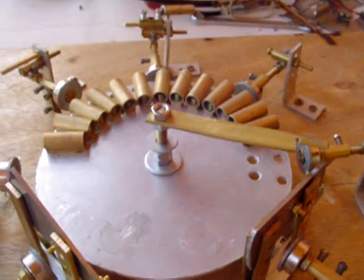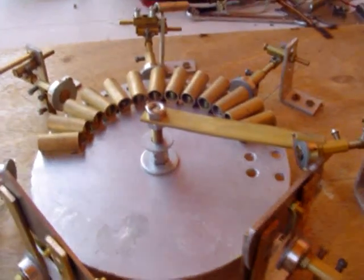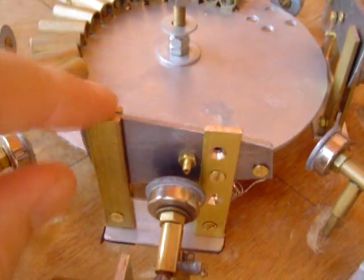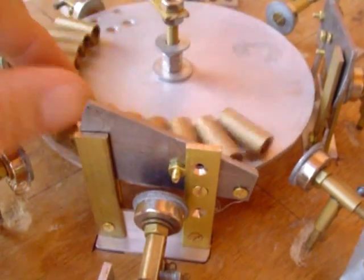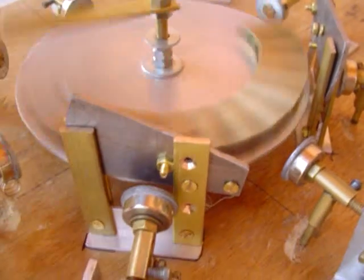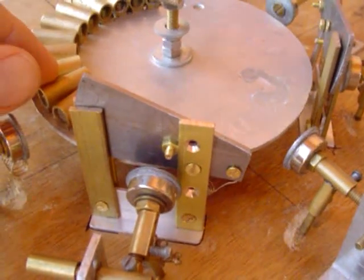Now to get that effect, if we can't physically lift the magnet, we must try and reduce the field somehow or other. So that leads us on to these weird and wonderful things here which I've knocked up — they're shields. The idea being that the rotor comes round and knocks the field off, or reduces the field enough. I don't want complete reduction of field; we just want a teeny weeny bit less magnetic flux on the stator to make the thing work, in theory.